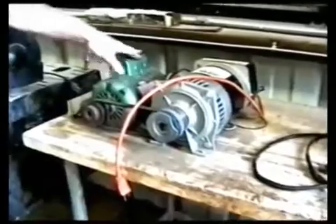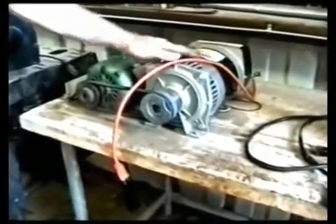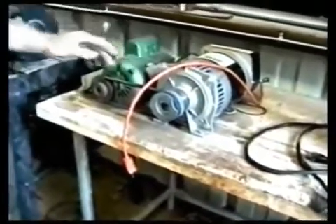What we have here is a motor-generator unit — a 2,900-watt generator and a three-quarter horsepower induction motor. What I'm going to attempt to do is start this up using regular AC power, flip over the system where the generator itself runs the motor. The generator has been modified, and a special coil has been built, so the generator will have enough power to run both a 14-amp bench grinder and a 16-amp drill press.